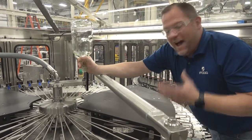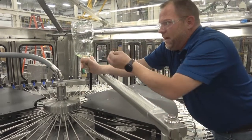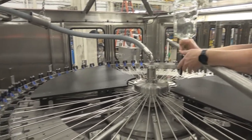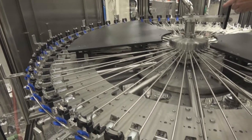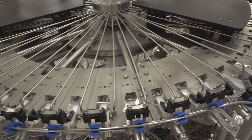We also have a segmented rotary union that pulses the volume so that as it drains out of the bottle, we give it time to remove the fluid so it doesn't interfere with a jet spray. We're going to go along the other side and I'll show you how we get almost all that product back out of this bottle.